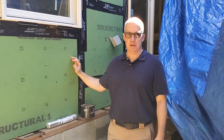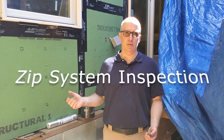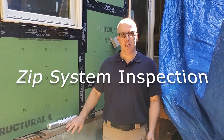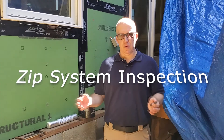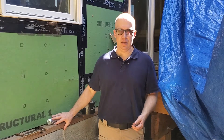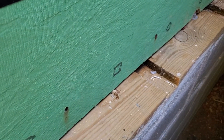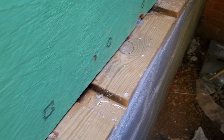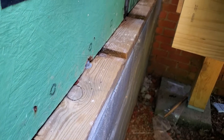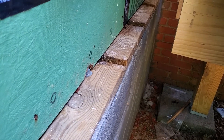Let's talk a little bit about the Zip System itself and some of the things we're seeing here. Our foundation got built out a few inches beyond where we wanted it to be — they were over-ambitious, wanting to make the plans a little bit larger. Unfortunately, now we've got this flashing detail that we have to deal with. We're not going to leave it this way. What we're going to do is create a piece of flashing with drip edge that seals to the Zip Wall and goes over the foundation wall, so water doesn't sit on this sill plate right here and gets out of the system.